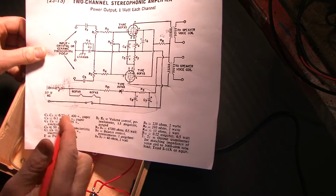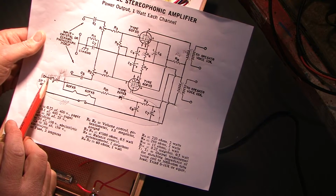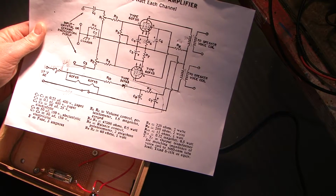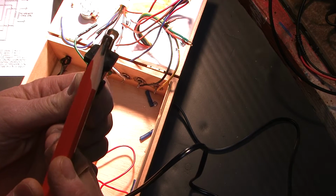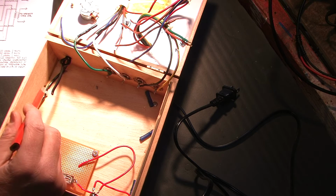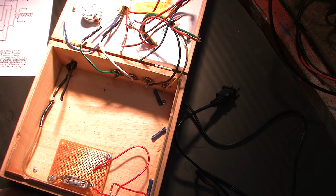You want to switch, and I don't know if you can see it, my switch is right here, and fuse the hot wire, the dangerous wire. And then the grounded wire will become your ground for the circuit. So with a cord, find the smaller of the two prongs or blades, and trace it all the way back into your amp. You could also use a continuity tester on your voltmeter. That's the one you want to hook up to your fuse and your switch, which is what I've done. And that's why I did that first, so I wouldn't forget.